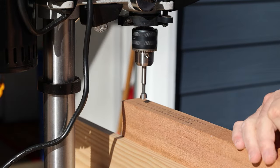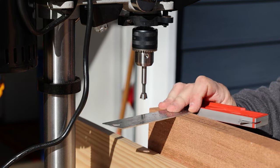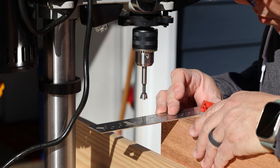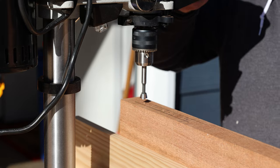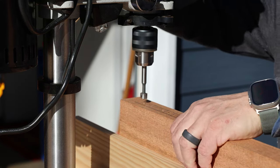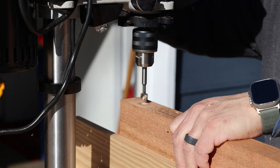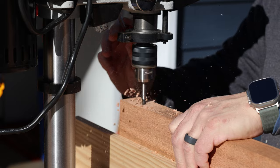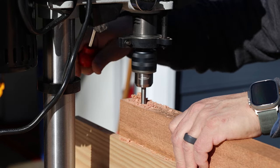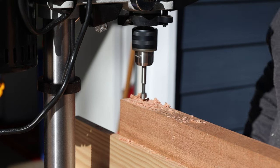My first challenge was to cut the mortises themselves. I have a router which I can use to plunge in and cut the mortises, but where do I start? Where do I end? How do I keep it from moving side to side? And I came up with this plan, which was to take a drill press with a quarter inch Forstner bit and cut the beginning and the end of where the mortises would go. Which brings me to my other piece of equipment that I bought - a drill press.